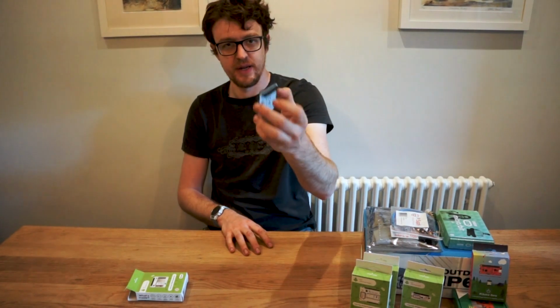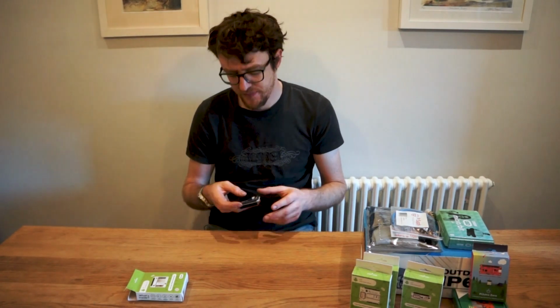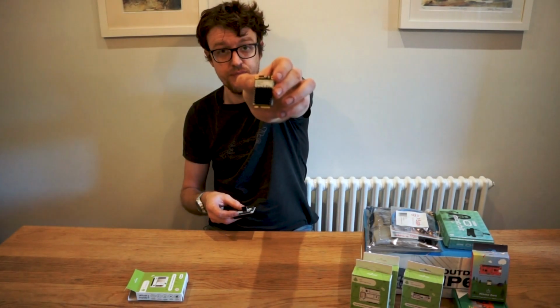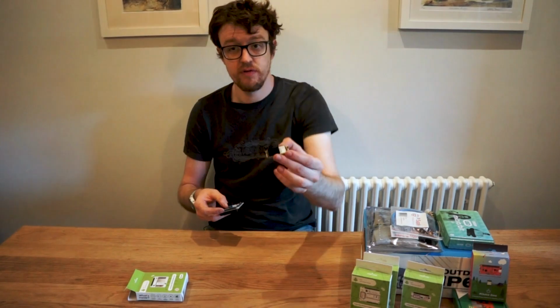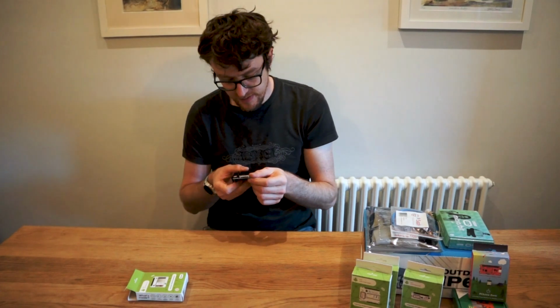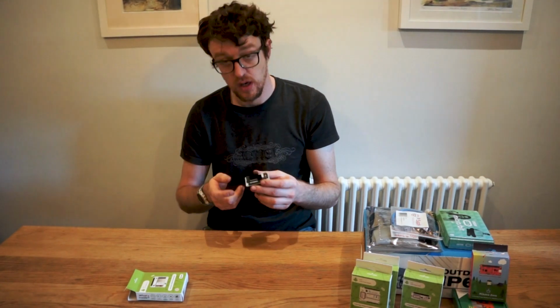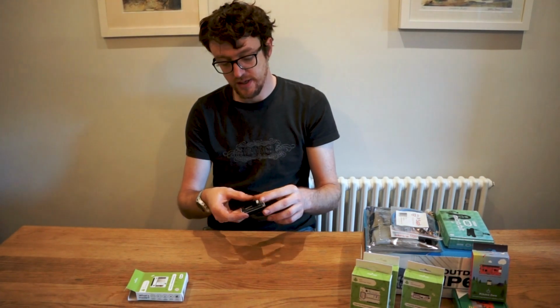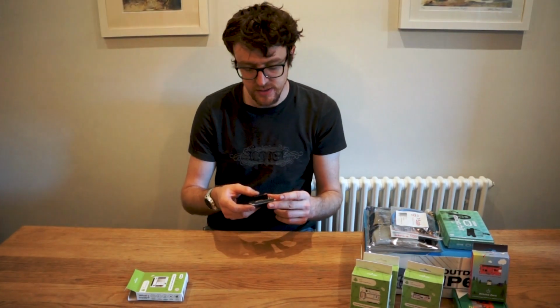As you can see, it's got the 40-pin header there. So it's compatible with any 40-pin Raspberry Pi. That's the zeros, 0W, and then anything from B plus onwards, including the A plus, 3B, 2B, 4B, all of those with 40-pin header. This uses a Rak 833 mPCIe LoRa module. Now on the newer versions we use a Rak 2247, but it's essentially the same thing, 8-channel gateway using the Semtech SX1301 LoRa chip on there. You saw me just plug it back in there, that just literally slots in and then clips into place like that. So it's super easy to use.